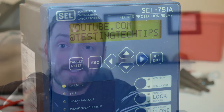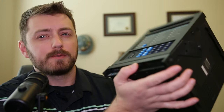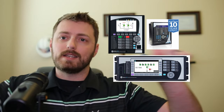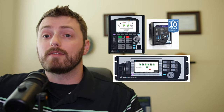Welcome back to the shop. Today we're going to take a look at all the steps required to talk to a GE Multi-Lin relay on the bench. Today I've got a GE 469 - this is a motor relay. They do have a more modern version of it; this one's been discontinued. The procedure is going to be very similar between this one, the 8 series relays - the 850, 869, 889 - the 750, and almost all of the substation relays, the UR series relays - those are the 19-inch rack-mount ones. That's your F35, your T60, your G90, your B90 - all those are the UR series.